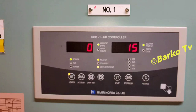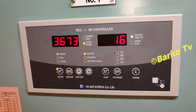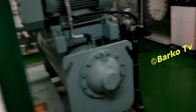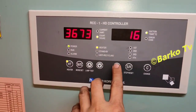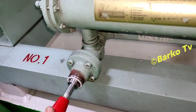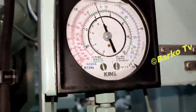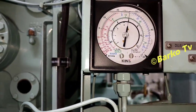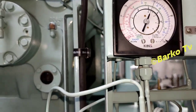Now we try to restart. The topic for this is only pump down — we already pumped down, and now we need to restart. You need to open the valve that we closed earlier. The indication is standby, meaning ready to start. But the low suction pressure is triggered. When we open this valve, that's when the compressor starts because it detects that there is suction pressure already.